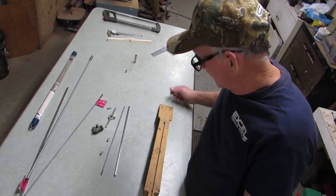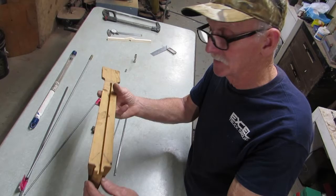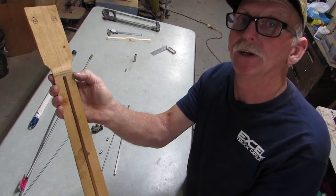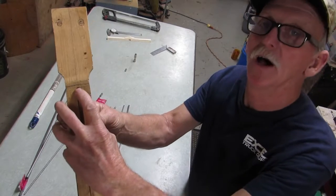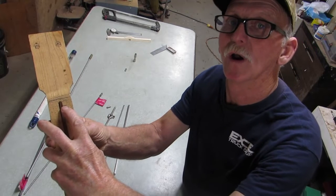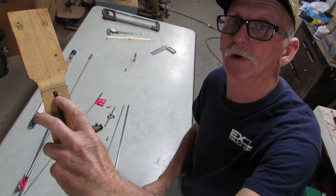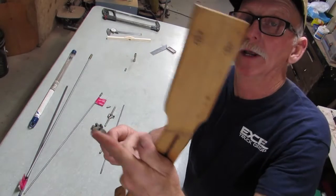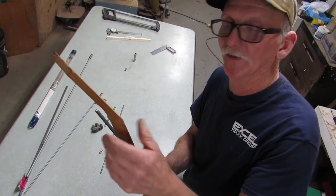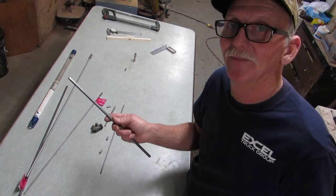I have my four pieces cut to make my truss rod. This old pine neck is a prototype I made way back when I made my templates and my tenon cutting jig — I keep it around for reference. This mark is the end of the fretboard. You can see I cut my slot to about an eighth of an inch from the end of the fretboard. The second mark is where I step the slot up. The slot is a half inch deep and a quarter inch wide, but up here it's only a quarter of an inch deep. I do that so the bearing end of the square stock will be pushing against some really thick wood, because I make my neck really thin. That may not even be an issue, but that's the good thing about making your own truss rod — you can design them any way you want.